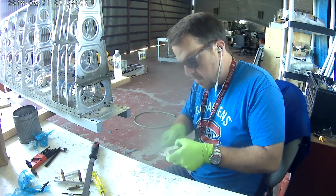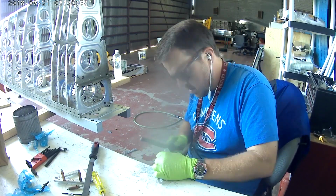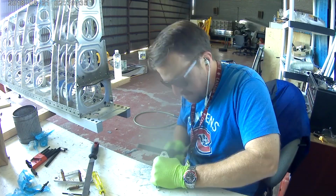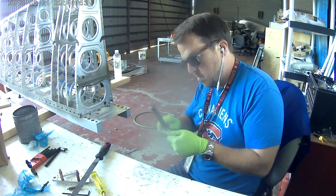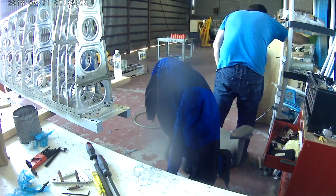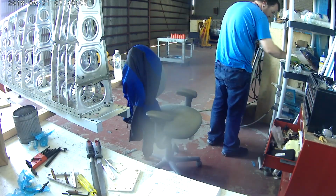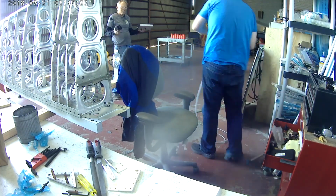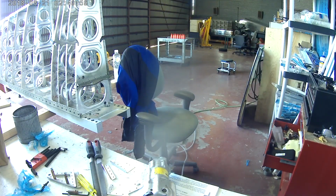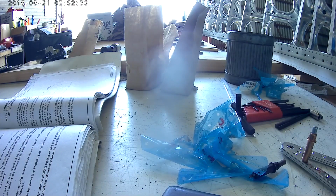Now, one of the things that they don't show you is that that new inboard bracket actually winds up moving in to where the aileron sits by a few mils. And it's enough that the edge of the aileron will actually rough up or scuff against the rivets. So I think Vans has changed it by now so that they're actual countersink or 426 heads that go there. But at the time of me receiving my wing kit, they were still 470s or dome heads. So what some people have done is they've just bought 426s and countersunk and put them in instead. And it's a -4 size too. So you need AN426 AD4-10s or 11s or something like that. They're really long. So that's what I did.